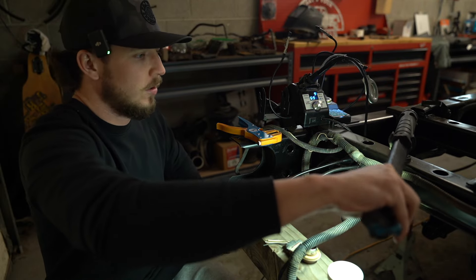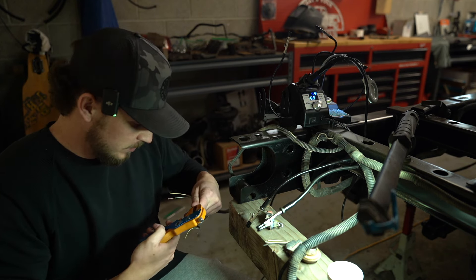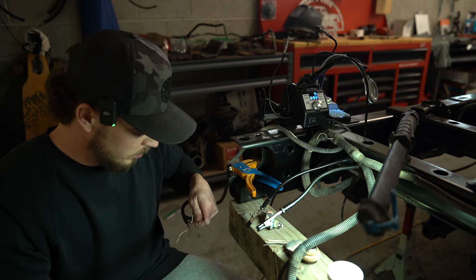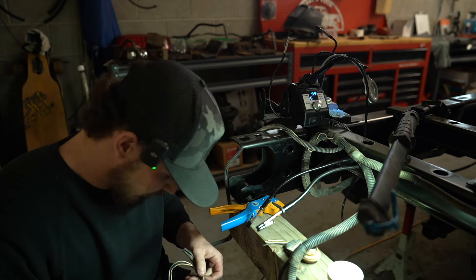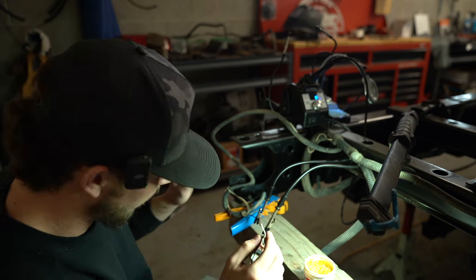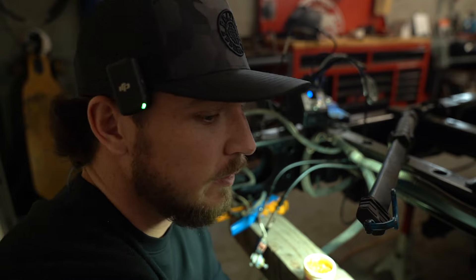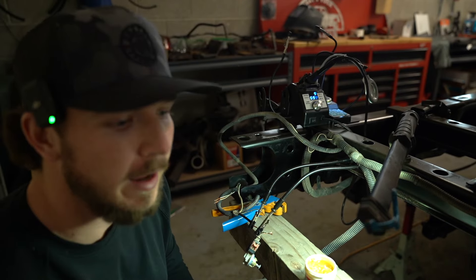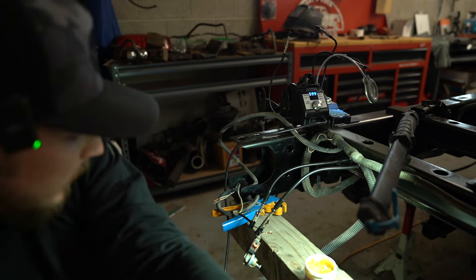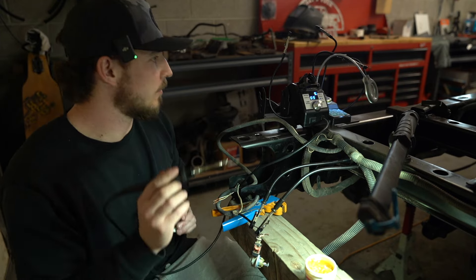New game plan: strip your wires a decent length — I left the back ones way too short, couldn't twist them properly. So give yourself plenty of length on these, because any movement is very bad. Don't forget your heat shrink — put it on before you solder. I've done that multiple times. Now she is completely stable. Heat gun, solder — get this puppy warm.